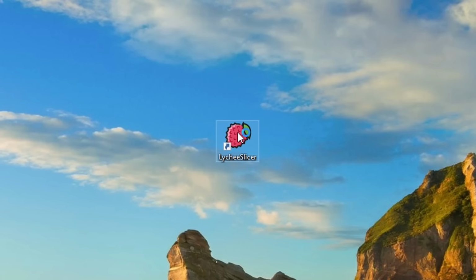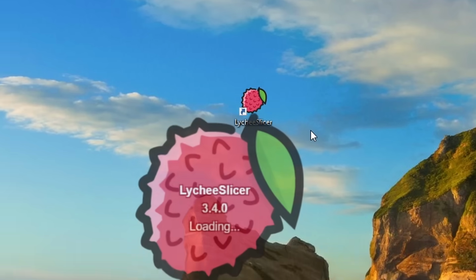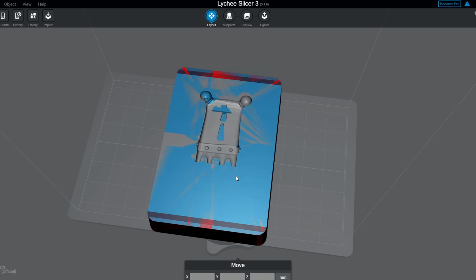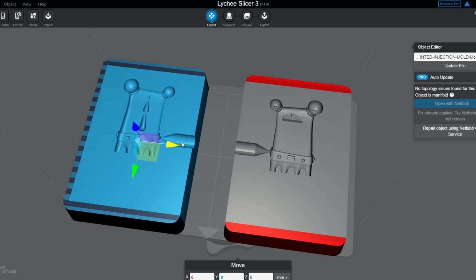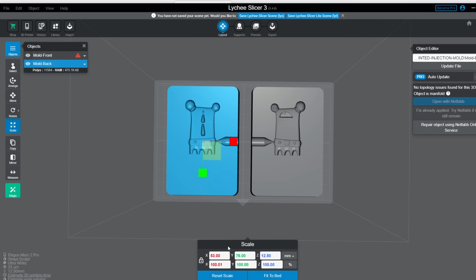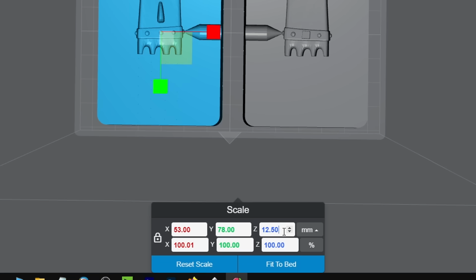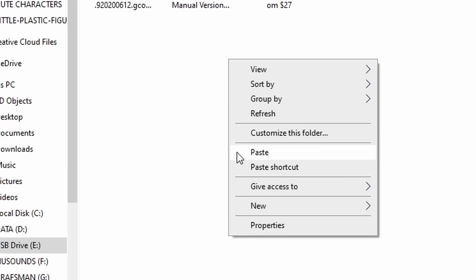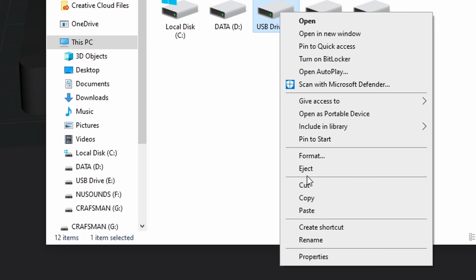Then I brought all that into my 3D print slicer. And this software just gets the parts ready to be 3D printed. But right before I printed it, I remember something. We need to scale that down by about 0.10 millimeters something. What do y'all think? I subtract 0.10 millimeter across the whole uniformity of it. Now we got our file generator and we're going to print it.